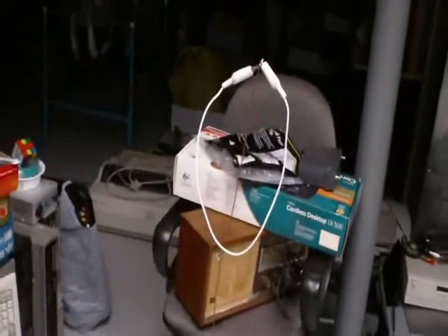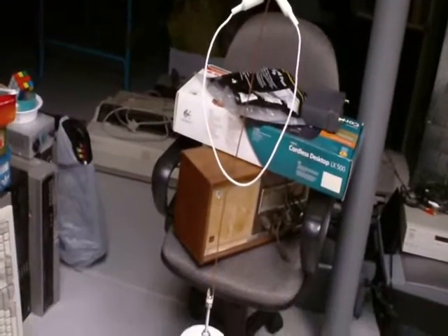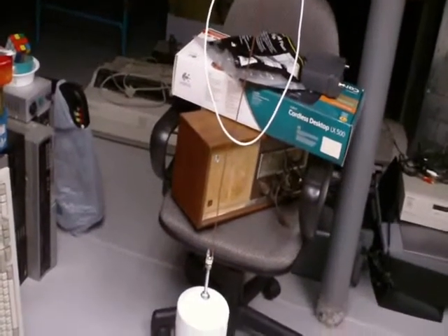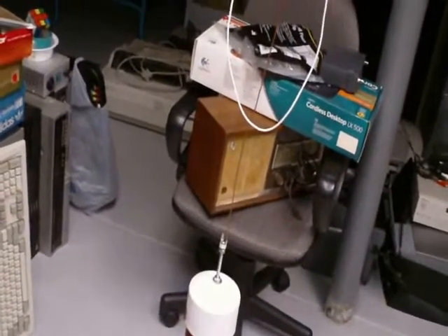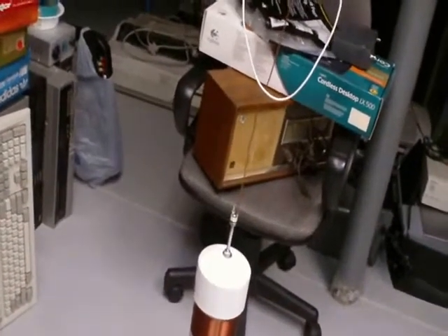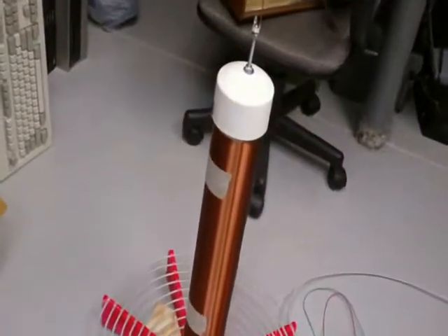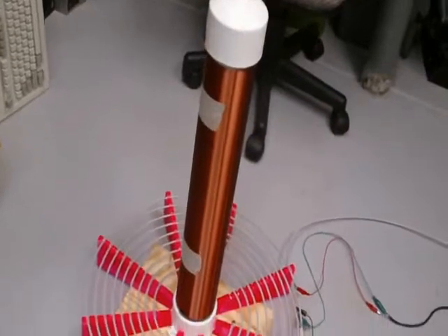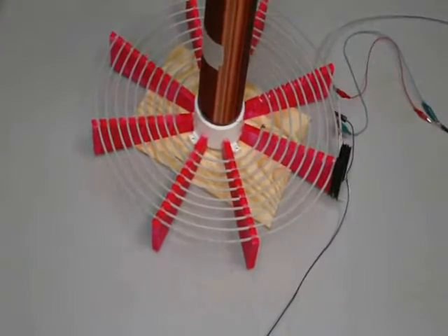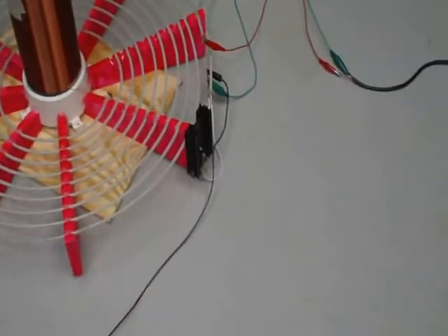I just don't have the time, so I just jerry-rigged the antenna on the transmitting end to be able to allow it to operate at the resonating frequency of 318 kilohertz. That's why I have that wire sticking out there. This is the transmitter resonator, that's the pancake primary, and that's the MOSFET.